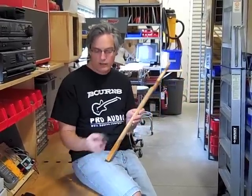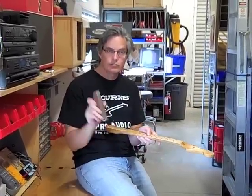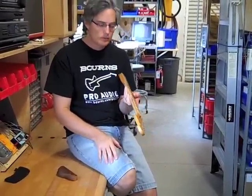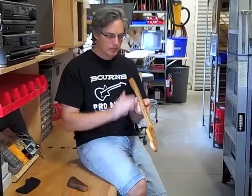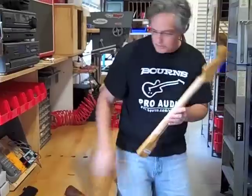Basically all we're going to do is just use a file. This is a StewMac file — I've had this thing forever. It cuts very smoothly, and files cut on the forward stroke. So we'll just run this along the edge like this, and we literally have to go down until we're into the wood. You could conceivably stop just about at the wood, but from a practical standpoint you can't do that — you're going to get into the wood a little bit, and that's fine. You can't stop shy of the wood or they'll still be protruding. You've got no choice but to get all the way down.